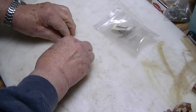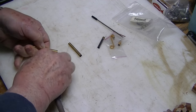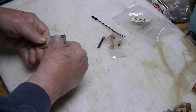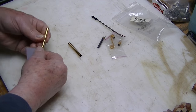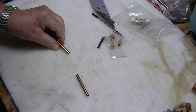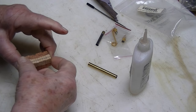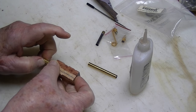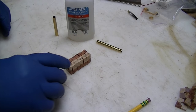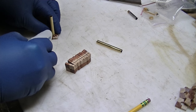Here's my standard kit. I'll take all my components and get them out of the way, but I need the two brass tubes because I'm going to start assembling the project. Before I do that, I rough up all the brass — the idea being that if the brass is rough, the glue will adhere to it better and will have some tooth for it to bite into. So I take a piece of 80 grit sandpaper and carefully scratch the surface of each of the tubes. I've slipped all the little slices onto one of the tubes and I've marked a pencil line down one of the light colored faces. It makes an alignment mark that I'll use later for checking the rotation as I glue these pieces together.